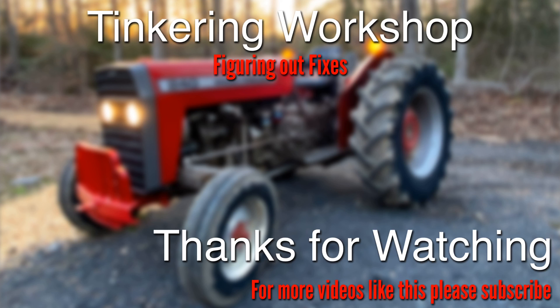A couple more things to do just to get this cleaned up, but basically that's just tracking down the cut that was in this line and then getting a new line run off a 12 volt that's on only when the key is in the on position. So now we should be good to go. That is rewiring and running the lines for the alternator on a Massey 240 - it's going to apply to a lot of old tractors, you could do something pretty similar. If you guys have any questions or want to know why I did stuff the way I did, just let me know and put it down in the comments below. Also any suggestions or other videos you'd like to see.